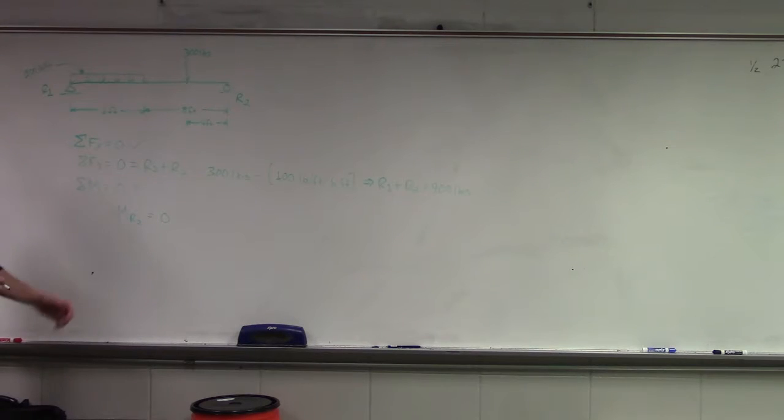And when you do that, you're going to come up with R1. When we do that, the equation's going to kick out R1. I think that's where I get messed up, when we're solving for R2 and then I get all the math done, I'll be like, okay, that's R2. And then I'll do the math and, okay, that'll be R1. Right, when you're doing the moment about R2, you're solving for R1.